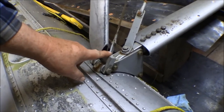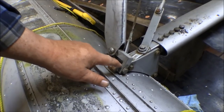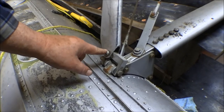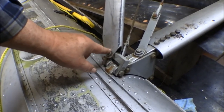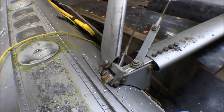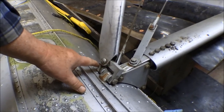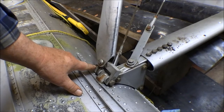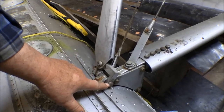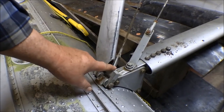I don't know whether they're cast, forged, or machined, but they're aluminum and you've got steel bolts going through them. I generally use cad-plated bolts on these because they're a structural member — a high-strength member. You've got a clevis bolt here and regular AN bolts here. So you have differential metal in there, and that stuff starts corroding because of the steel inside the aluminum and the reaction with the salt water. These blocks are about $500 a piece. I usually watch them and if the bolts start rusting, I'll just take them out every three or four years anyway and replace them. The bolts may be $15–20 a piece, but it's a lot cheaper to replace those every three or four years than to replace one of these blocks.